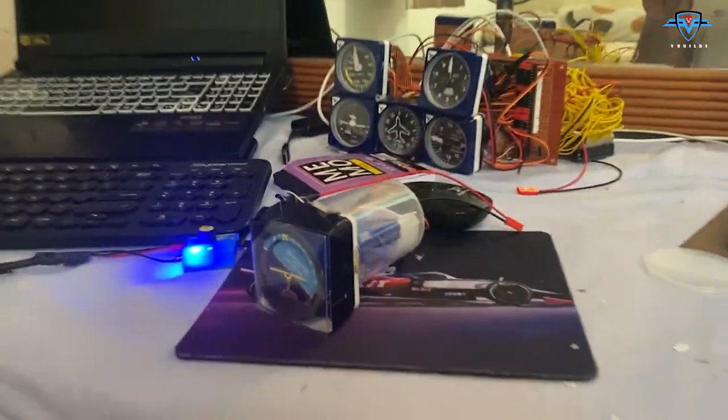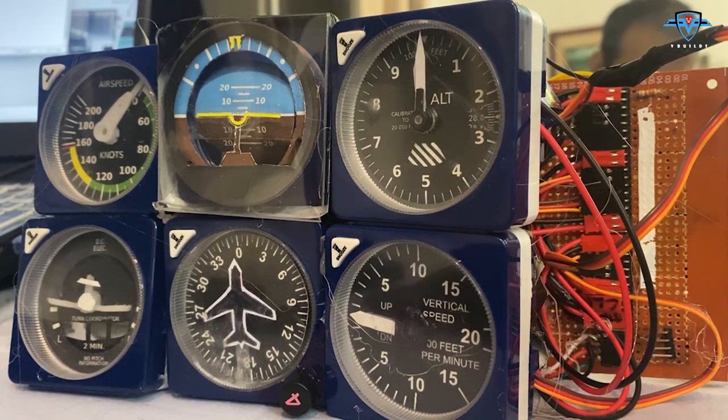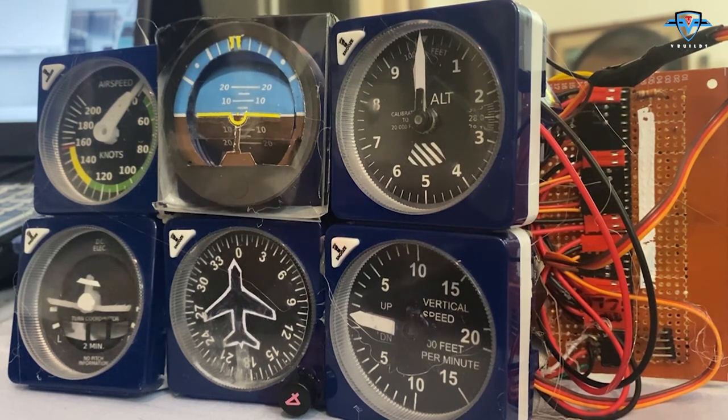Let's quickly do that. Now this roll servo is connected to pin number 32. I have my servo check program, based on which I will decide at what values it shows what angle. So let's see. Let's try 100, 90. Okay, 90 is this much. So 100 again, 102, 105, 104.